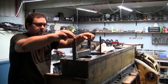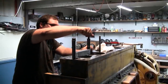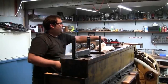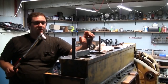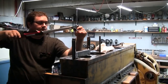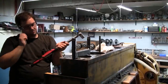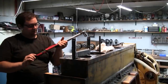I've got a couple nuts and washers here. We've got to torque these to 50 foot-pounds and we're going to do it in two steps - we'll start at 25 foot-pounds and go up to 50. This is a funny torque wrench - it's got an electronic display but it's still like a spring type.